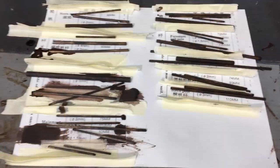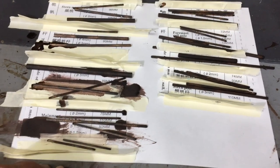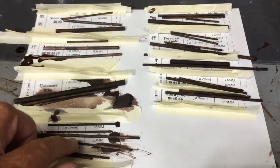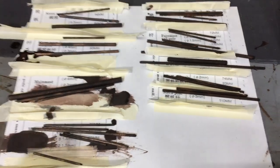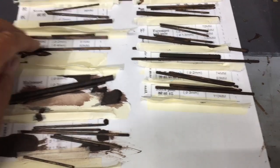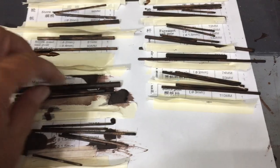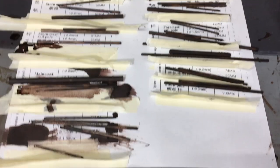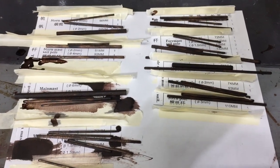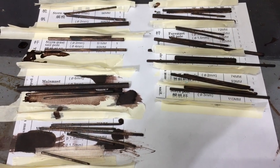I've only flamed a few things in the past - this is the first time I've done it on large scale. It did make the wood absorb the stain a lot more, so they're very dark. I prefer dark myself. There is some variance to it; if you look closer at these back here, you can see some are very dark. I put aluminum foil in the staining tray so I could keep it clean - it leaked out a little bit but still worked pretty well. I have them all stained now, and it's a matter of sorting which masts they go on.